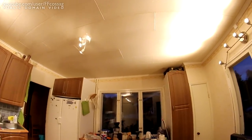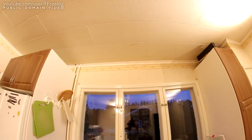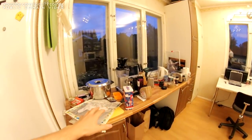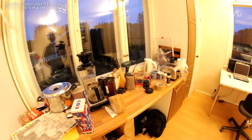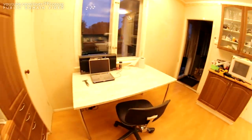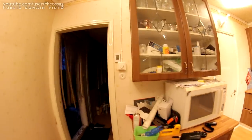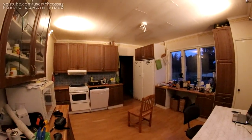I've been running around poking everywhere with my light meter. With everything turned on we have about 250 lux at the oven, about 200 in that entire area, and generally the room is about 100 lux in the center. The dinner table is very evenly lit at exactly 100 lux with very soft light — just look at that lack of shadow. It's a very comfortable light, just what you need when you want to chill out after a long day. I'm quite happy with how this has turned out, except I still want a light over there. Turned down to minimum it's about 20 lux all over — this is a very good evening light.